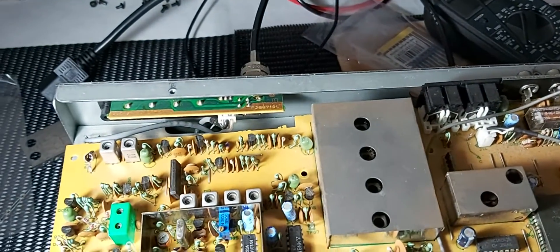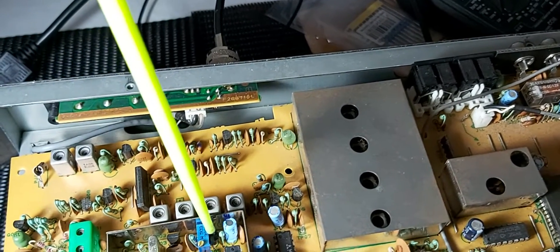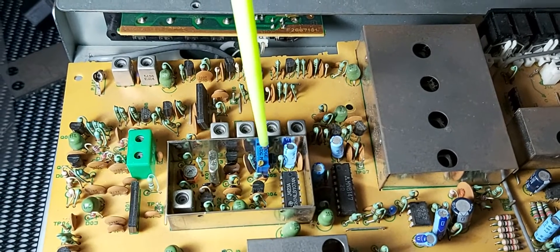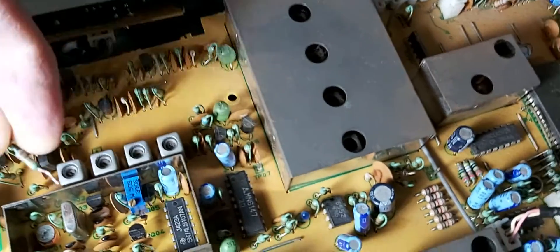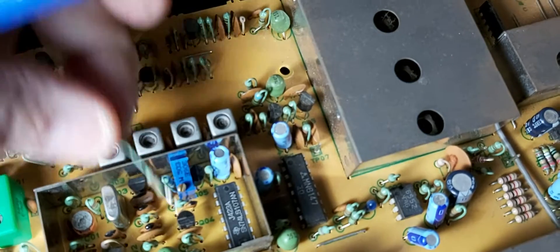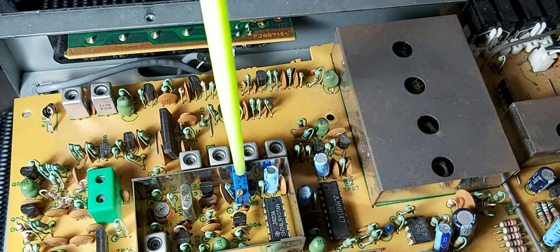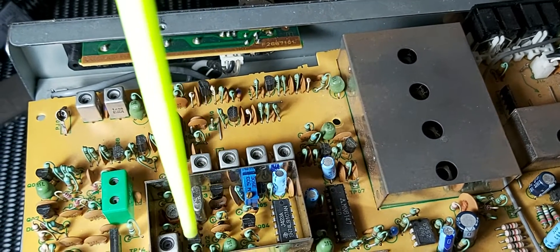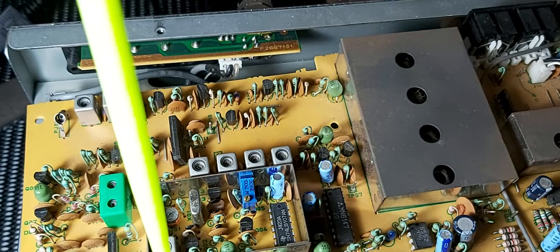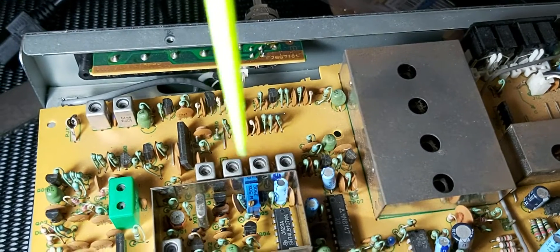What it was, was R18 in the PLL circuit of the receiver, which is right here in the PLL section next to Q5, that transistor there. That was a fixed 22k resistor — there it is. I ripped it out and replaced it with a 25-turn precision trim pot, 50k, so mid-span would be around 25k. Using the trim pot: at minimum resistance it goes out of lock, at maximum resistance it goes out of lock, but in the middle it stays in lock.